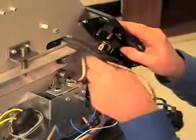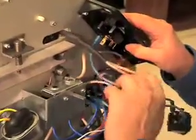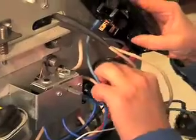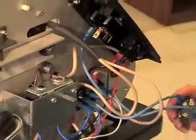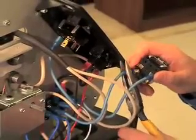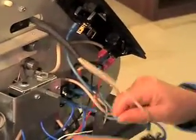You'll replace that with the new wire. It goes on top of your switch into where you just removed it from the terminal block. Then you will take wire 2, which is on the bottom of the switch. You will slide that off. That goes to terminal block 2 on the second position down.